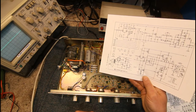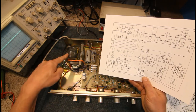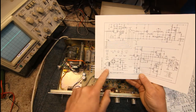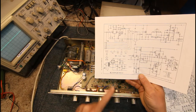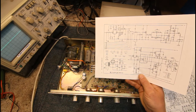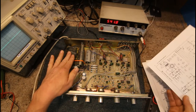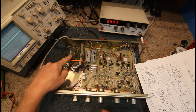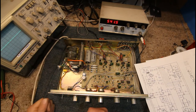Most modern ones have fuses on the primary side. Generally they're fused after the transformer, usually straight after, in case the bridge rectifier shorts out. Technically this is not the best design because if the bridge rectifier shorts out it could cook the transformer — especially since these old transformers probably haven't got a thermal fuse like modern ones. But generally power problems are pretty rare in amplifiers. Some later amps will have a thermal fuse in the transformer.